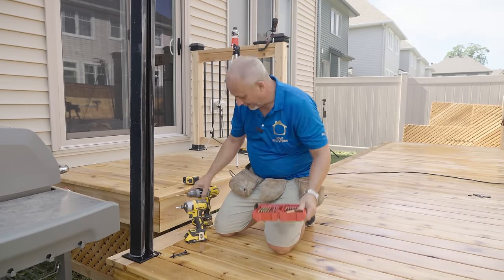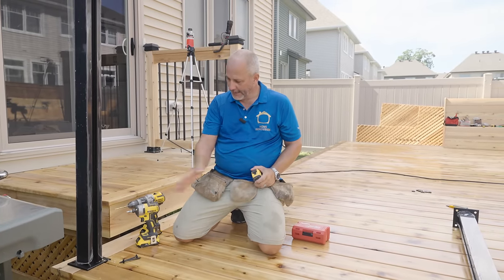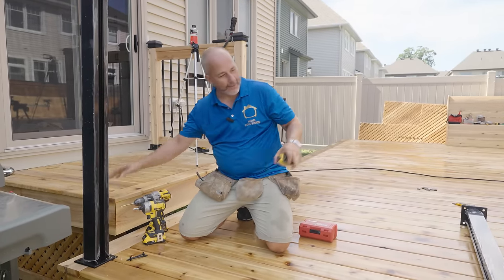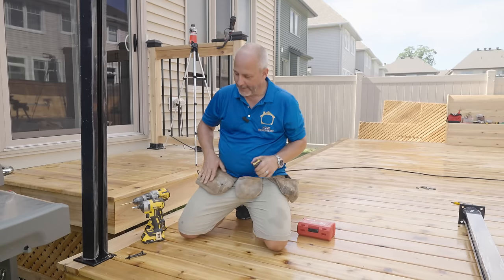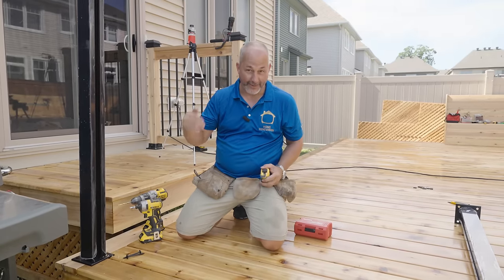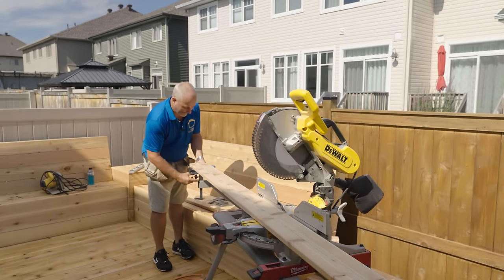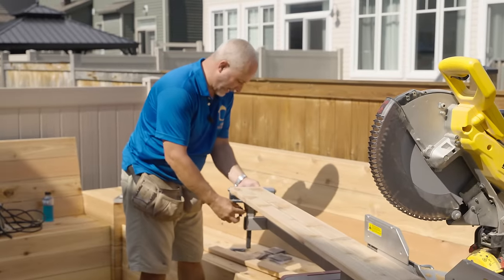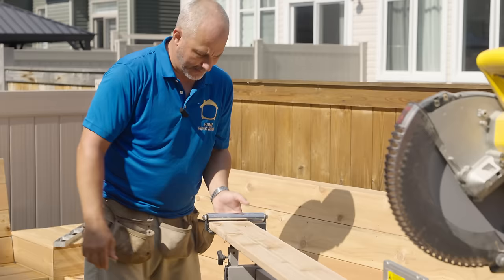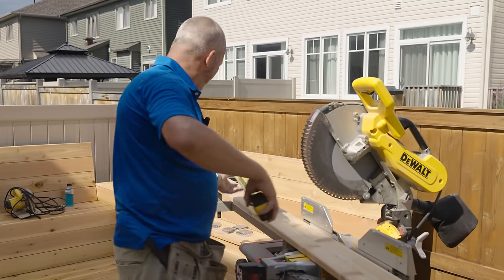All right, now, that's good for all my hardware. I have 10-foot boards. I'm going to go with 5-foot sections. And then this is more of a 4, and the last section there is going to be a little over 5. So that's fine. I'm going to show you how I'm going to set up my saw right now, because I'm going to cut all my wood in advance. And then this is just assembly work. So the secret here is to have a saw stand and set up what's called a saw stop. Okay, that's the limitation to the material. So now I can measure.